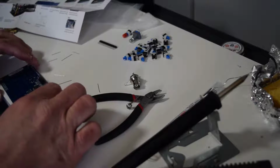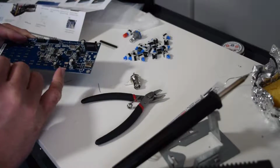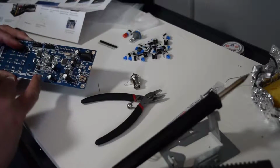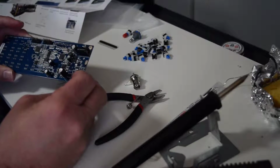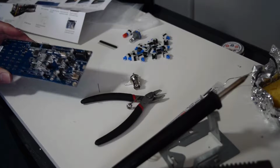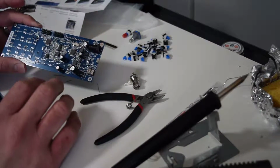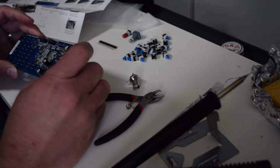All right, one quick note on board layout. The stripe on these electrolytic caps is the negative side of the part. And as you can see, these little caps, they have the polarity different on all of them. Wouldn't have taken much effort on their part to flip them around, make it a little easier for assembly. But it is what it is. So that's all the solder side, or backside components. I think they call it back. Yeah, backside.